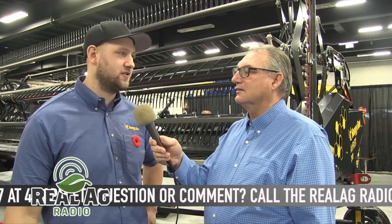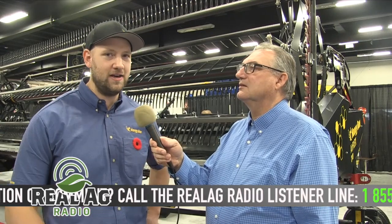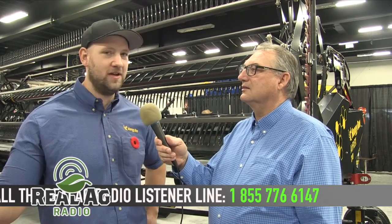That's great. What are some of the other things? Like there are actually attachments you can put on depending on whether you're doing soybeans or canola or that kind of thing? Yep. You can put on a cross auger if you're cutting in more bushy crops. You can also put on what's called a vertical shear system for canola. And that, particularly in tangled canola, reduces crop loss and allows you to sort of cut in any direction and make sure that all your crop comes to the bin.